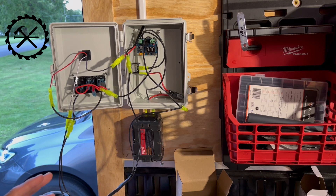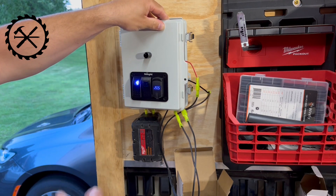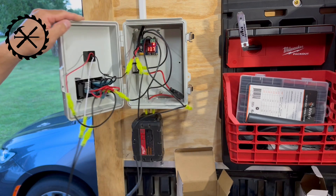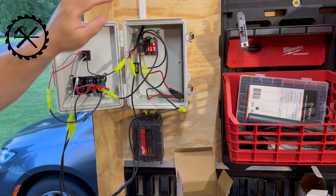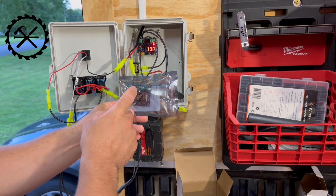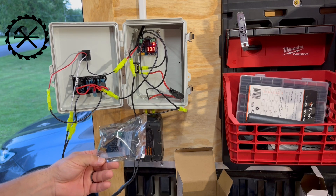That's what I have right now, and it does work. If I turn the power on, it shows me that that's on. It also powers my lights - you can see the light turned on. Now this is reading 20.4, 20.5 volts. My disconnect is reading 13.7, 13.8. I think something might be wrong with this disconnect. So I went on Amazon and ordered a couple more disconnects. I'm going to change this out to see if this makes a difference, or maybe it's just always offset - but that's like six or seven volts different, which is a huge difference.